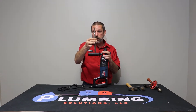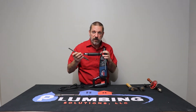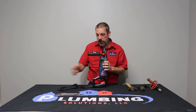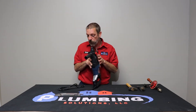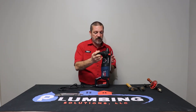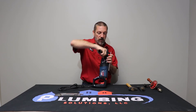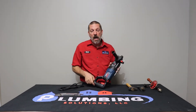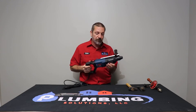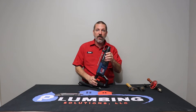Remember, this chuck has grease in it, so whenever you're messing with these, those ends are going to be greasy. If you're using this for a long period of time, that grease is going to get runny and get on your bits and your hands — just be careful with that. Chipping hammers most of them have a second handle that you can position anywhere you want; you just unscrew it, move it around, and tighten it back up. I highly recommend you always keep two hands on this tool because it is going to jump around and it does have a good bit of power.